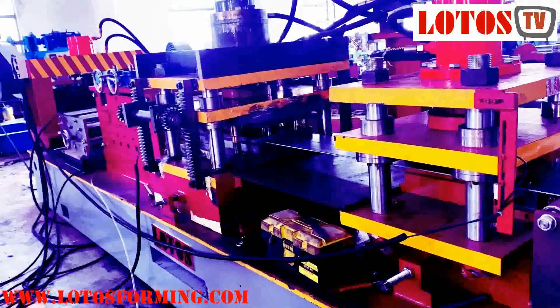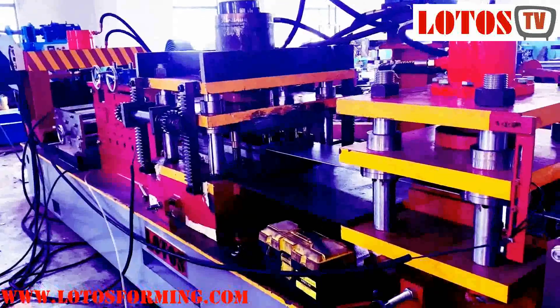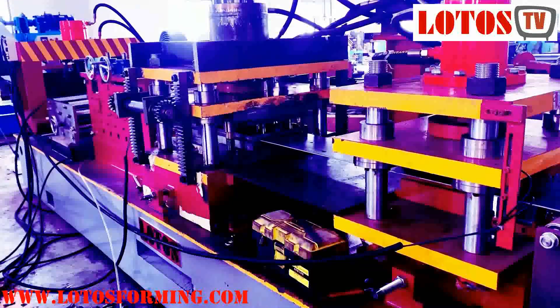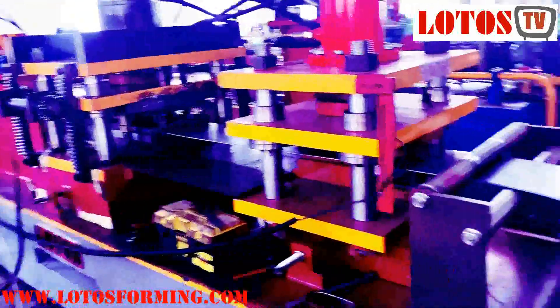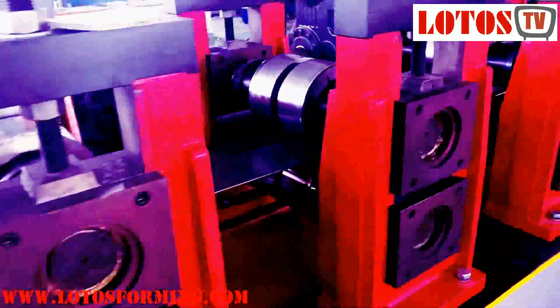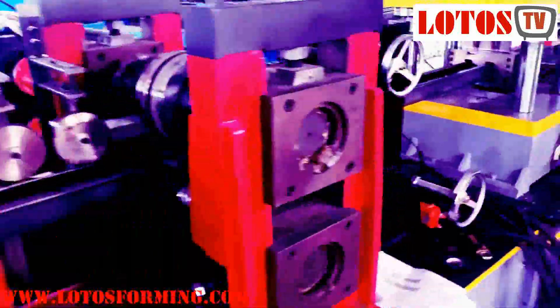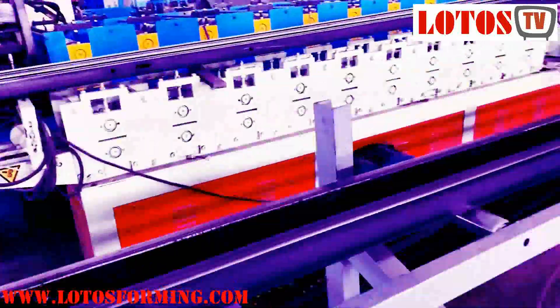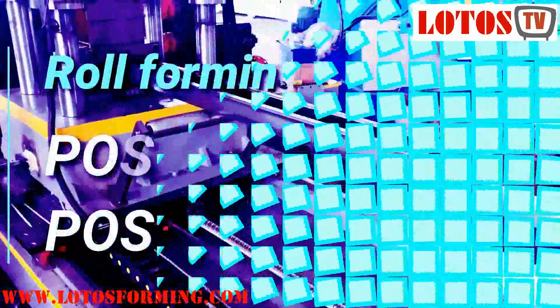In this view you can check: pre-cut, leveling, punching, again punching, then going forward to form the material. This machine is for five-millimeter thickness C-post beam. You can see the holes on the material. Based on the design, we decide whether to use post-cut or pre-cut and punching. Here is the final profile — it has a hole.